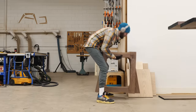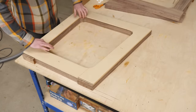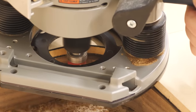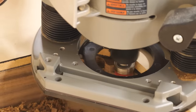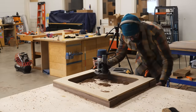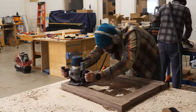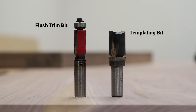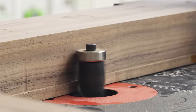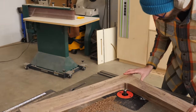While Sean was taking care of the cabinet, I continued working on the legs to refine and finish the shape. The first step was to use some double-sided tape to attach all four template pieces to our legs, then use a flush trim bit to work my way around the entire inside perimeter, flush trimming my workpieces to my template — except in the transition areas where I float away a little bit. I'm working my way down, and then when there's just a little ledge left, I'll switch from a bit where the bearing is at the base to one where the bearing is at the tip. This is actually a templating bit and that is a flush trim bit — apologies for the confusion. You can do this by hand or on a router table, but once you switch you have to remove the last little bit of material in one pass, which is why I like to work my way down as far as I can before switching.